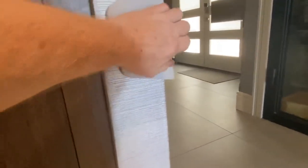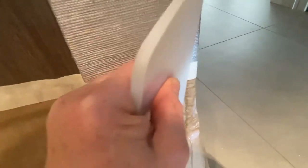So obviously we want to use gravity. We want to go as high as possible with the incision, and then we want gravity to pull our paste downward. And when we're pushing on that plunger, we want the paste to be going down rather than back up, or you don't want to be cutting it in the middle and then, you know, you'll be smoothing up and down, which is not that prudent, right? So we get as close to the air pocket as possible.